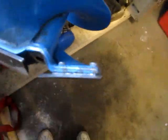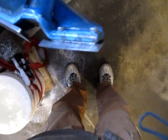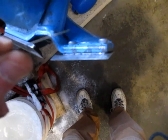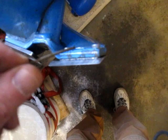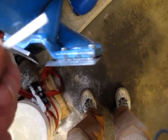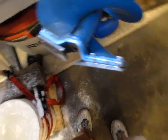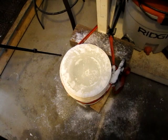Okay, so I sharpened the blades. I don't know if it'll show up here, but I installed shims. I made some out of some aluminum I had, because these guys are about the same thickness. Hopefully the aluminum's a little thicker, but these guys kept sort of falling out and were hard to find, so I thought, well, I'll make up a few extras in case I need them. So I'm just going to set things up and try another ice bucket test.